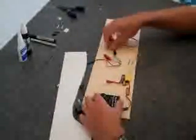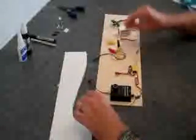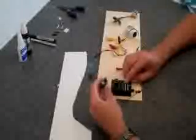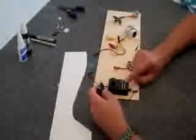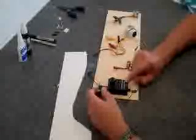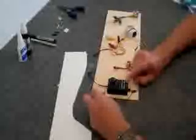Another recommendation is, this is a testing board that I've got with various motors and speed controls and alligator clips. This is kind of what I use to test different types of equipment on. You can hook a speaker. This is a servo driver, and the servo driver is nice because it'll allow you to test your servo before you put it on the airframe. There's nothing more frustrating than putting a servo on an airplane that doesn't work. So you ought to try getting a servo driver in your toolbox, your hobby toolbox, because they come in very